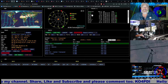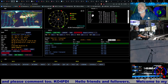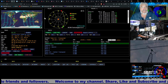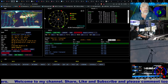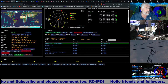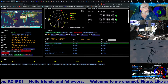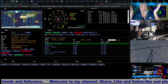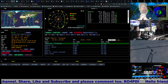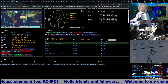And the one thing I like that's cool about the satellite, even though it's getting dark out, because the antennas contrast against the sky, you can still see it. On the right is the 2-meter antenna, I believe. Yeah, on the right side is my 2-meter. That is a 5-element 2-meter antenna. That's the same one I had before. But on the left is a 23-element 70-centimeter antenna, homemade. Guy sold it to me for $50. I can't beat it. And it should work fantastic. It's supposed to have 21 dB of gain. I'm going to start with the preamps on, but I may shut them off just to see if I can still get it. What I'm hoping for is that when IO-117 comes back again, which tonight is at 11:02, I'm praying that I can work that satellite again, that there was something wrong with the other 70-centimeter antenna. Oh, that's going to frustrate the hell out of me.